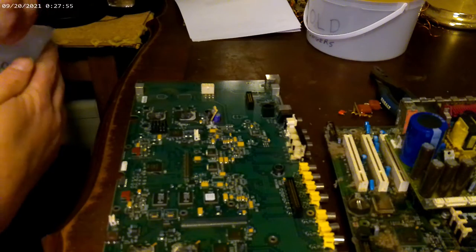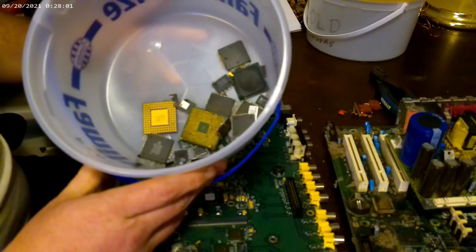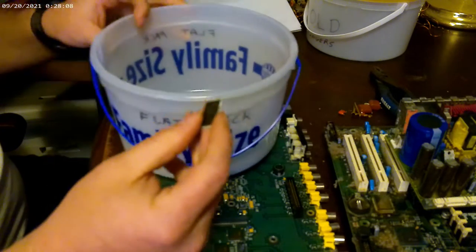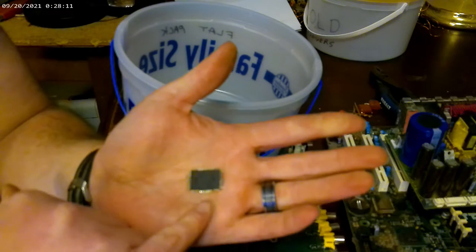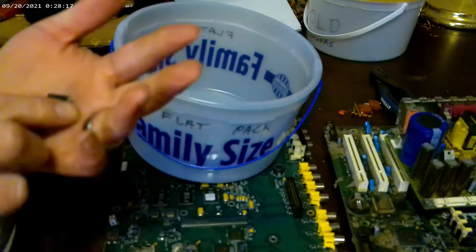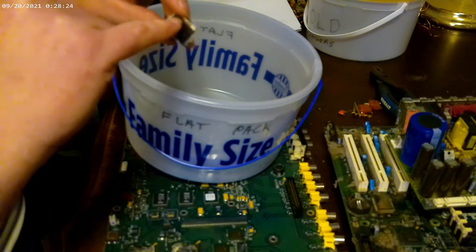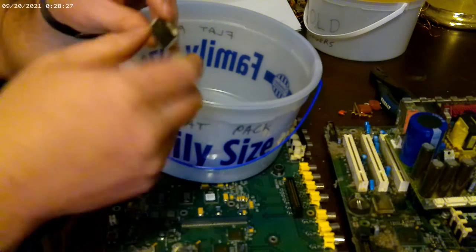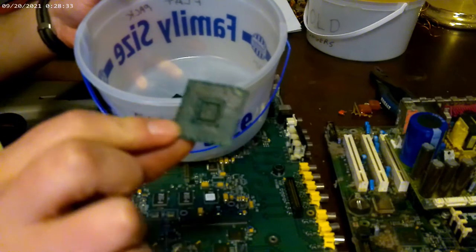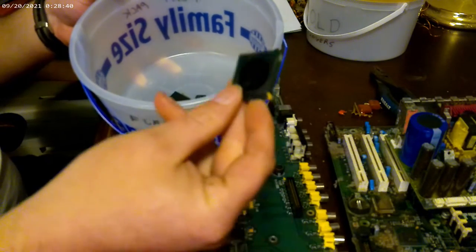I've got these marked as flat packs, because that's just what I know them as. There's all your big processors and stuff. I put my four-sided in here too — there will be some changing of this stuff as I go down the road. See, it's got four sides that are connected to the board. All of them have little itty-bitty gold bonding wires that run from each one of those little tabs in there to the center where it's got another gold piece. Your newer model ones look kind of flat on the bottom — they connect straight into the board.